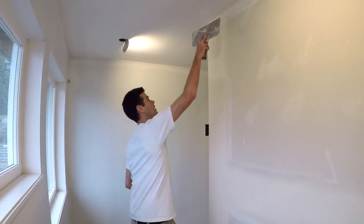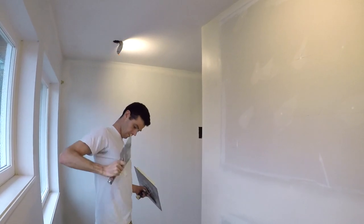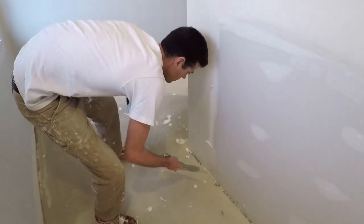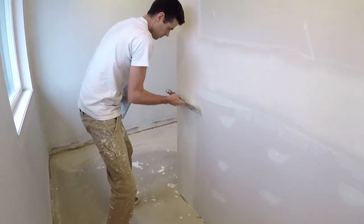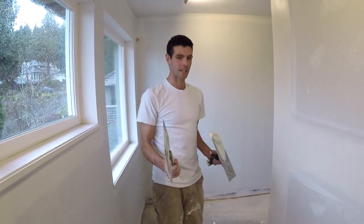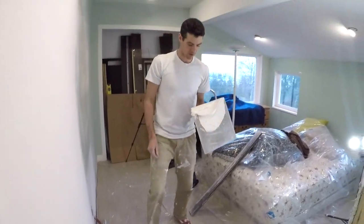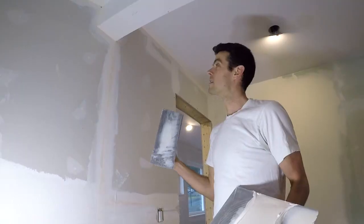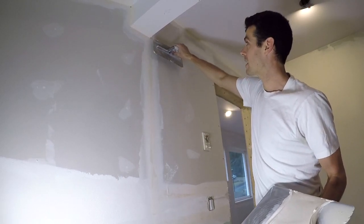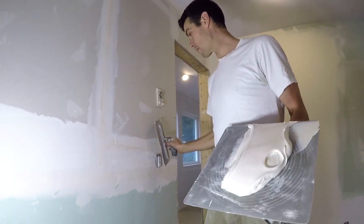Well, you may as well finish it. That's looking a little better. Okay, let's do a little more just to make sure that the people who actually use and love the hook trowel feel truly represented. Let's coat this butt joint and see how we do. I can either go once down the middle using the curve to build it up there, or go once on each side — but what I can't do is give the whole thing one nice even coat, and I definitely am not going to be able to feather into here after I finish.